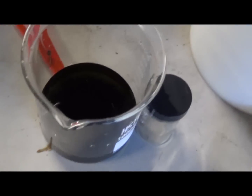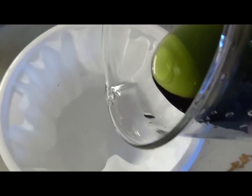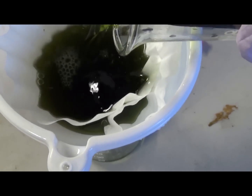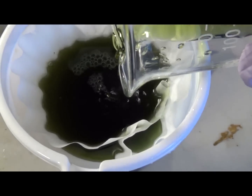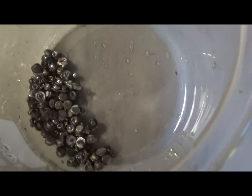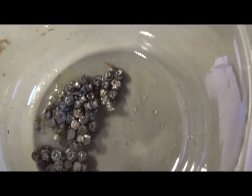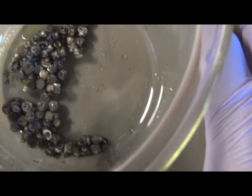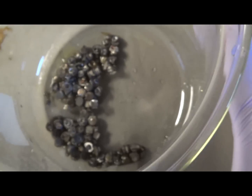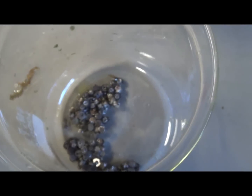Let's take a look at what they look like when they're done. So the ones in this beaker have been in there for about a week. And that's what we're left with — you can see all the little bits of copper and brass that were stuck to them have come off, and what you're left with is silver. Sometimes you might see a little bit of remaining copper stuck on them — that's fine, just throw it back in the AP — but for the most part, that's how I recover silver from electronics and from the silver contacts.